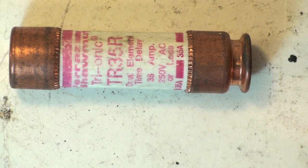If I put a 60-amp fuse on here, I would need at least number 6 wire, and number 6 is a much bigger wire. I will be overdrawing my circuit and my wiring is not designed for that high a fuse rating. So you have to put the same fuse in that you took out — you're playing with fire literally here if you don't.